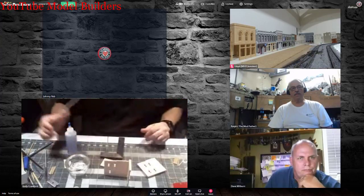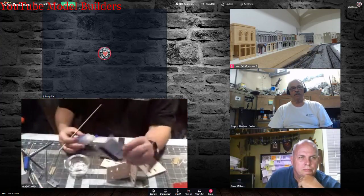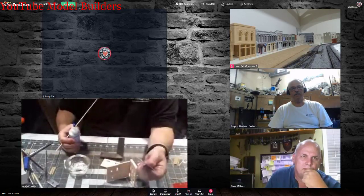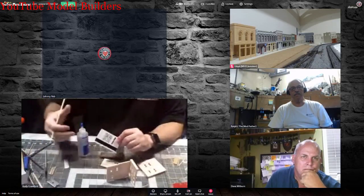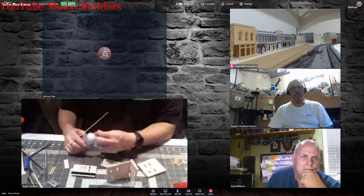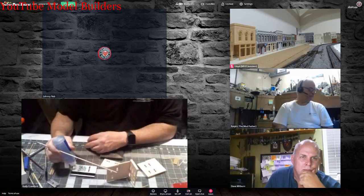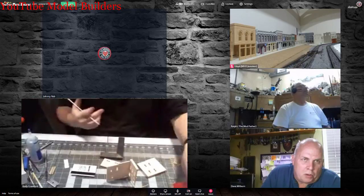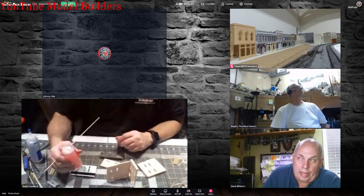Actually, one of the best tricks for doing epoxy, most glues honestly, is these. I save these hotel cards that you're supposed to get back, I think. I save these things, and I usually put super glue or epoxy on them. They're super handy. I cut little squares out of them. That's what I use to insulate between rails, too. It's a good plastic.